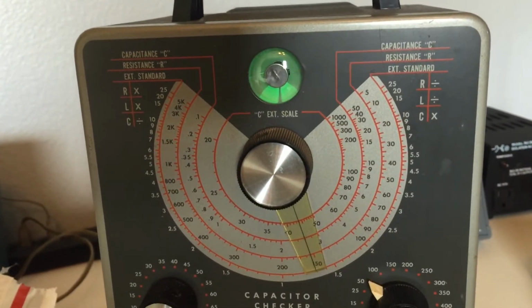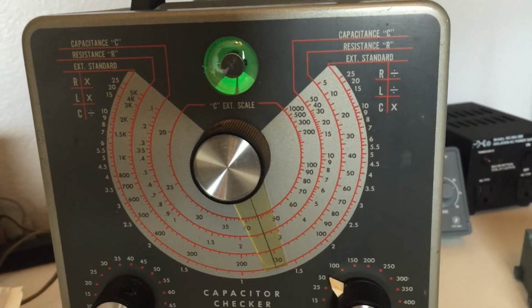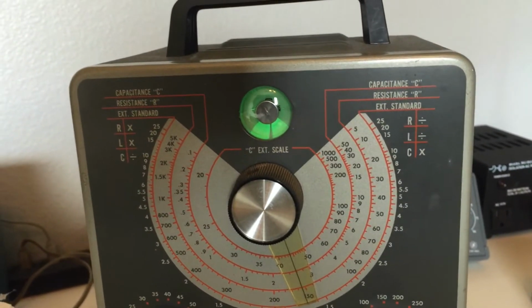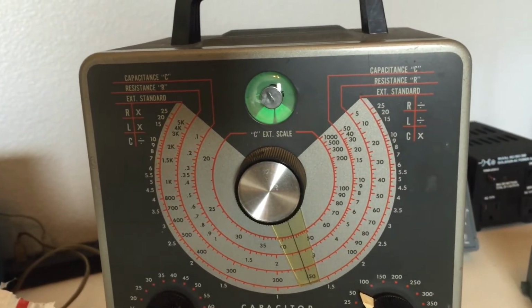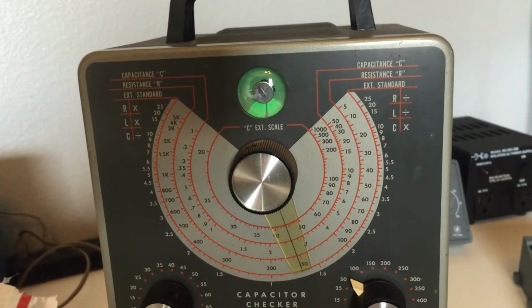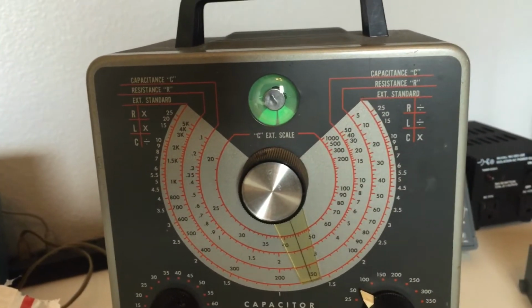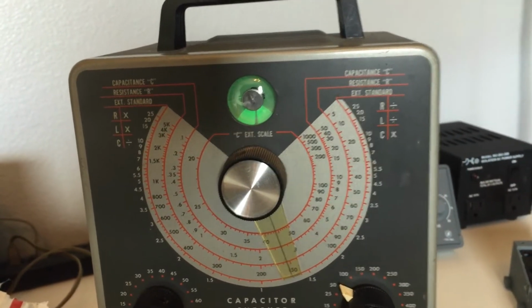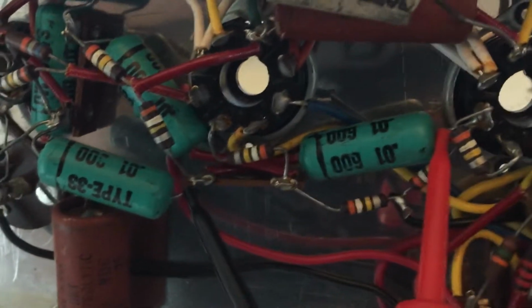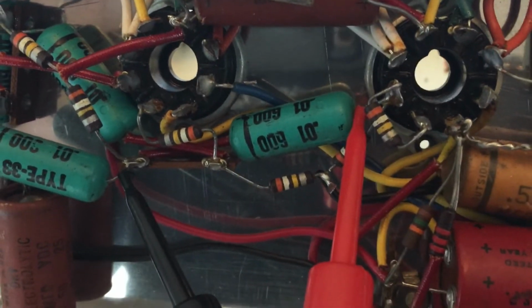So if you think about it, yeah, you're using your strictest measurement. Yeah, but my strictest measurement is dying at 50 volts. So, if I were to go with a more lenient measurement, would I make it to 100? And so I see what it does. And even if I multiplied by 2 and said, okay, we'll go with mini lytic, but we'll say it's 2, then it's like good for 100, maybe 150. These are rated to 600, so I'm going to say that one in particular would be no good.